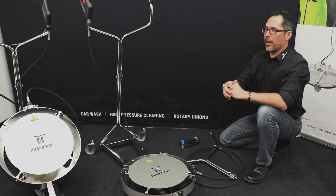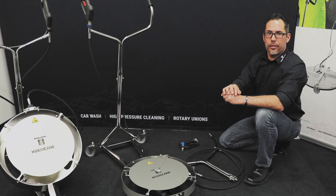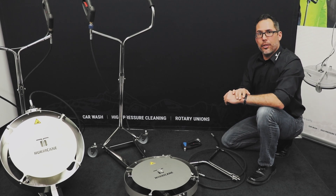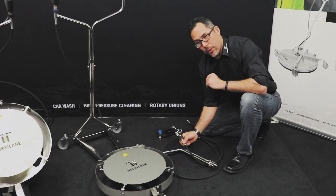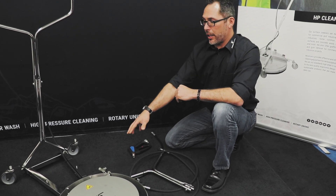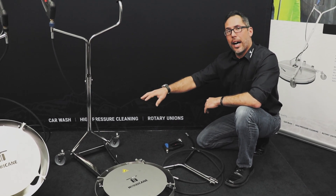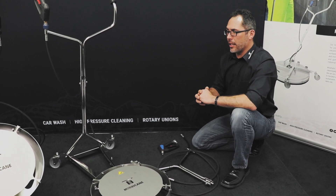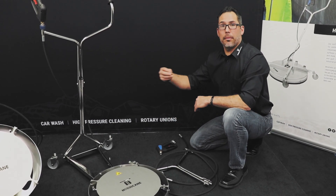During the demonstration you saw the advantage of using the soap chemical draw for salt neutralizers, degreasers, and soaps. The 80.618 is the only unit that has it as a standard option; however, we do have an upgrade kit, part number 80.9011. This consists of the draw block, the upper forks, the gun, and the bypass hose system. This allows you to upgrade our standard Hurricane undercarriage cleaner, the standard high-lift, or the standard Hurricane Pro so that all different versions can get the low-pressure draw upgrade kit — maybe it wasn't advantageous at your first purchase, but it's something you can always add in the future.